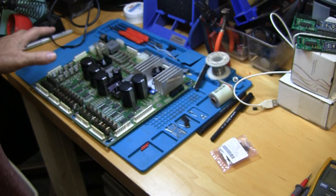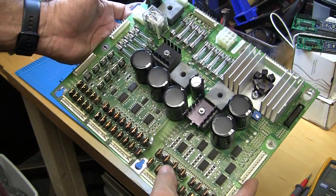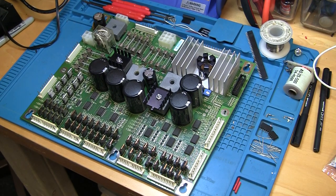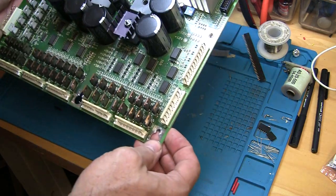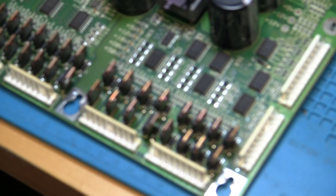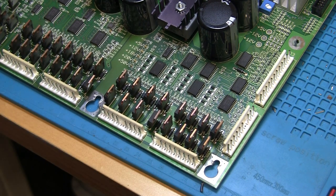Since the coil was burned, I figured the driver transistor is probably blown too, and I needed to find the transistor on here and replace it. The easy thing is to look on the driver board and identify a blown transistor, because sometimes when they go it's really quite obvious. In this case Q18 is right here and there's no real indication there's anything wrong with it.